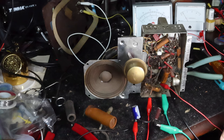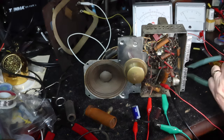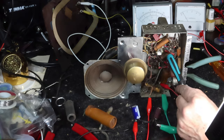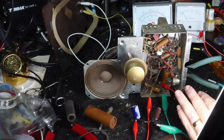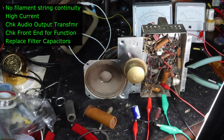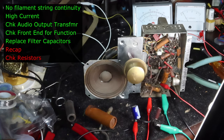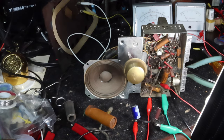And the coupling cap for the audio output is located down there. It's that one that you see laying sideways. He's got to go right away. So I'm going to go in, tear out the paper caps, and get this thing put back together again, and I'll look at mounting these two guys, and I'll bring you back when I get all that work done. So hang on, and then we'll look at how it sounds, maybe touch the alignment.